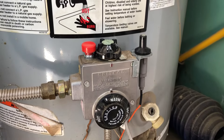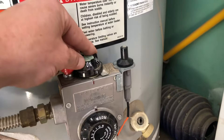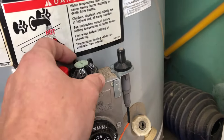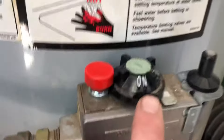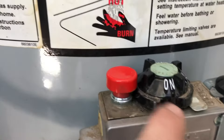It had me a little frustrated because it's just a bit different than what you normally do. You're going to turn this all the way to the off position. There is a little lever over here which allows you to push the button beyond pilot. Turn it clockwise, depress this tab, and press it all the way to the off position. You'll notice these little cutouts in the wheel — one there, one on the pilot side. The reset button can't go down unless it's in one of these cutouts.